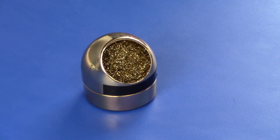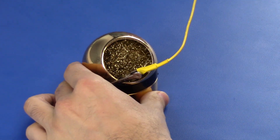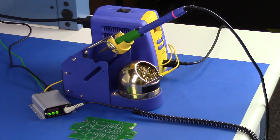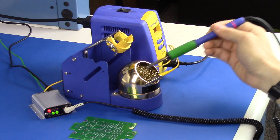As an alternative, the yellow cord may also be connected to conductive soldering iron tip cleaners. This method would allow the operator to catch any overvoltage from the soldering iron when it is cleaned prior to use on a circuit board.